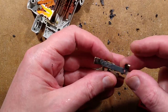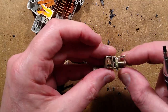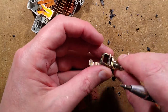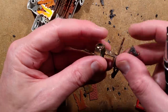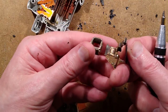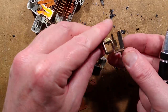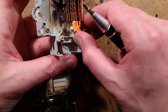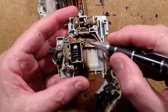Let's try and get this out and take a look at it. So this is the bimetallic strip - it's a heater element, and normally it would heat up and then flex and trip the breaker. But in this instance it doesn't look like it successfully tripped. The screw has been clamped - the wire looks decently clamped in there. I don't see excessive burning around the connection; I see heat that's traveled up from the bimetallic strip.